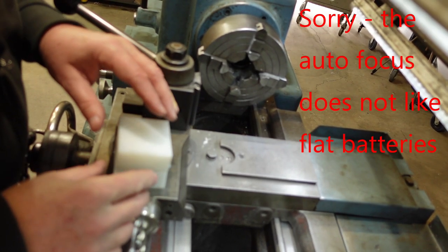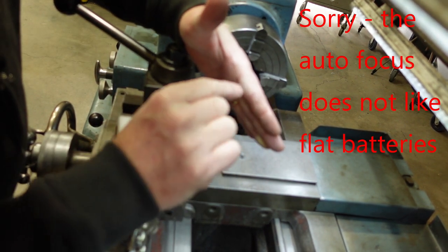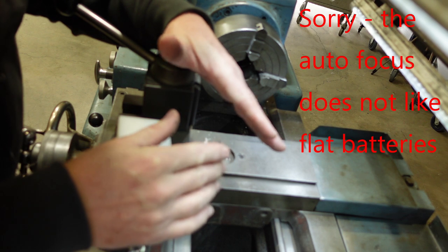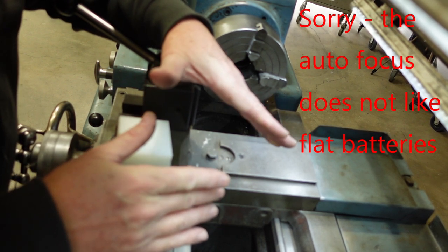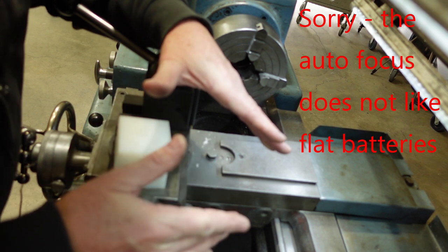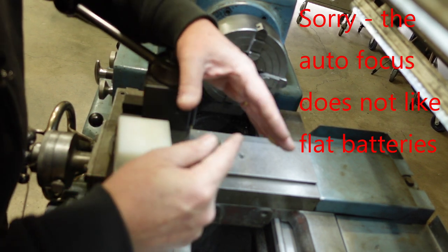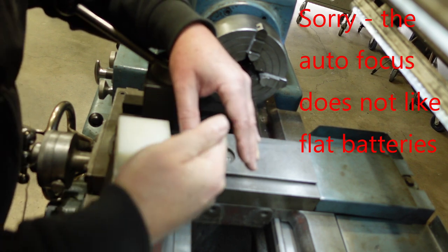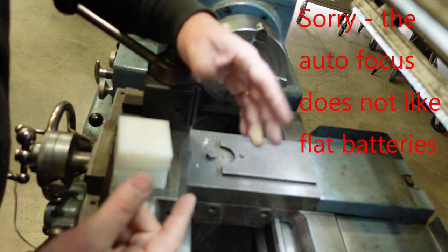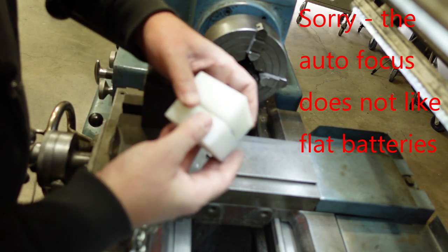There are two ways to make up the truss. One is the fish mouth thing where one tube fits over the other — I might end up doing that for some joints so I can run cables through the tube. The other way is basically drilling a hole into the larger tube and then putting the smaller tube in and welding around, which gives you an equivalent joint.